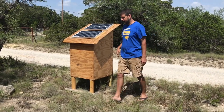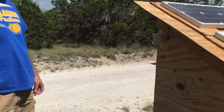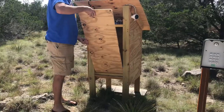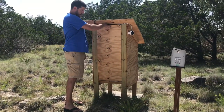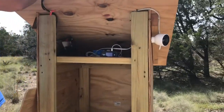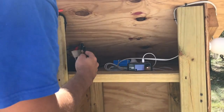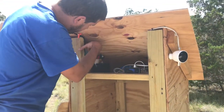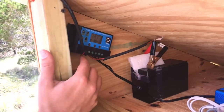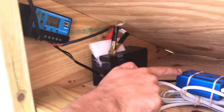This is the other side — my door that sits in here to keep the rain and wind out. Remove it and what we've got here: the solar panels have two wires that come together and are wired in parallel so that they stay at 12 volts but double my amps. You can see it goes into the solar charge controller, which is kind of the magic piece.